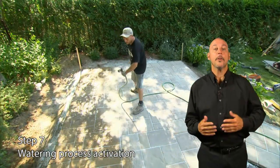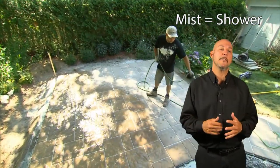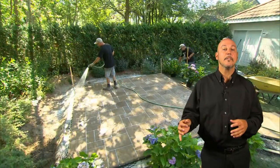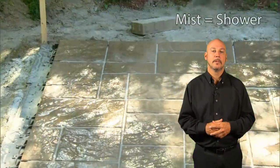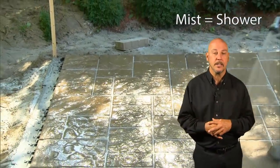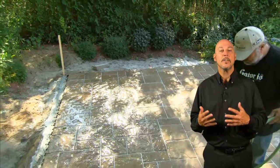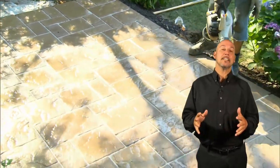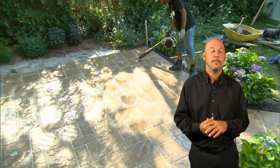Step seven: the watering process. Set your sprayer on mist at a height of four feet and spray the paved surface for three to four minutes, no longer. On a hot summer day, avoid doing large surfaces as they dry faster. At a height of two to four feet, mist and rinse the paved surface for three to four minutes, no longer. Mist and rinse a third and final time simultaneously to eliminate any unwanted residue. Stop rinsing once there is an accumulation of water in the joints. Finally, use a blower to remove excess surface water from between the joints and crevices — this process will help eliminate any potential hazing.